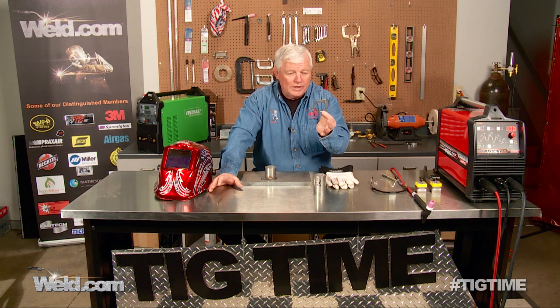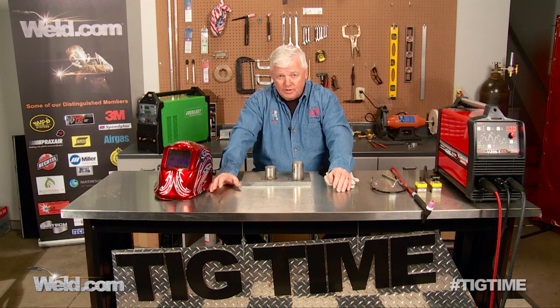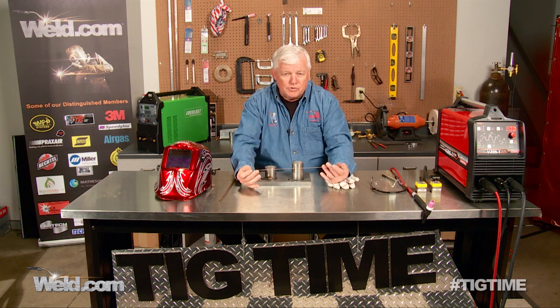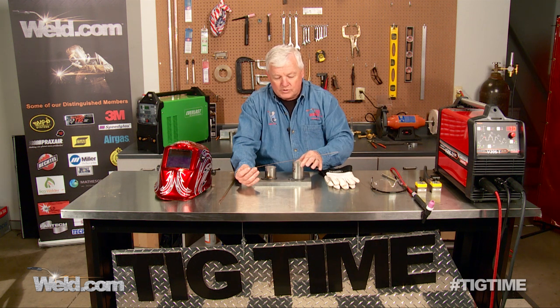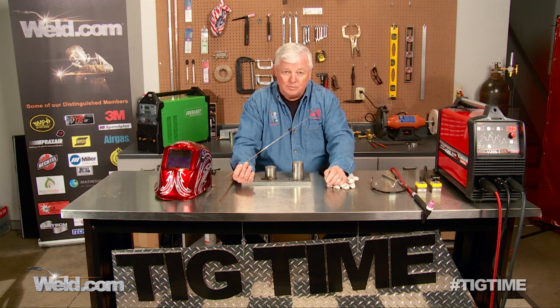The steel melts at approximately 2,730 degrees Fahrenheit — some pretty high temperatures. When we start brazing, we're never going to reach that temperature because we're going to use this filler. The melting temperature of this filler is about 1,800 degrees. So when we start dabbing it, just like in TIG welding, we're not going to reach the liquidus — it's not going to shrink, it's not going to distort. You can see this used a lot in the automotive industry. Today we're going to show you steel on stainless steel, and in episodes after this we're going to show you some other applications where you can use silicon bronze.